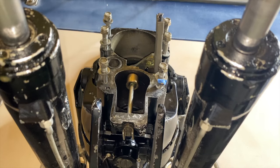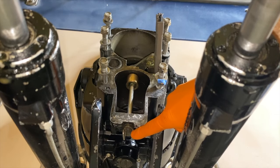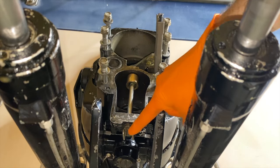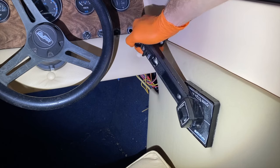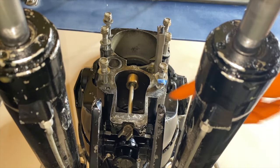I'm going to turn the propeller counterclockwise to move the shifter back to a straight position. I've now repositioned the camera underneath the bell housing and transom assembly to focus on this shift shoe or shift slot — it needs to be positioned in this way, which will be in forward gear when sitting in the captain's seat. I'll hop into the boat, into the captain's seat, shift to neutral to show what that does to the mechanism and slide up top. In neutral, it is now offset and the slide has been pulled in — in this configuration, it's impossible to install the out drive. Shifting back to forward gear, we are now properly configured to install the out drive.